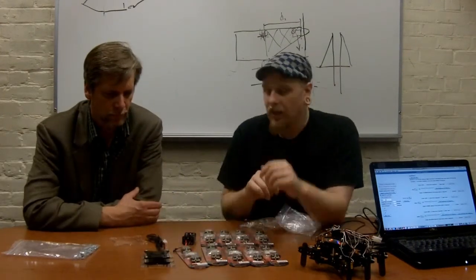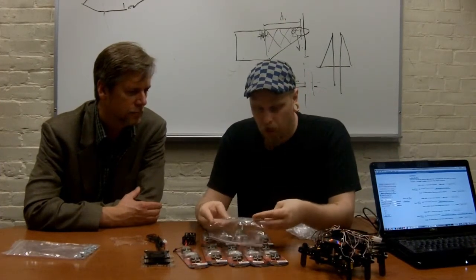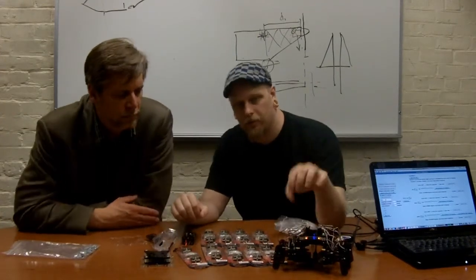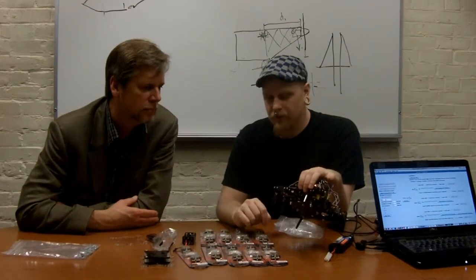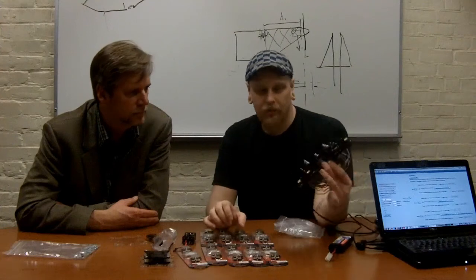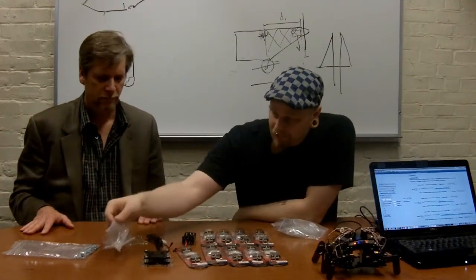As part of the kit you also have a set of washers, which are actually cut out of the laser-cut acrylic. There are two types: one type is a spacer — you can see one here on the end of the servo — which allows the screws from the servo kit to run through the acrylic and into the plastic underneath without causing interference on the other side. The other type is just a standard-style washer used as spacers in various places, also cut from the same plastic as the rest of the kit.